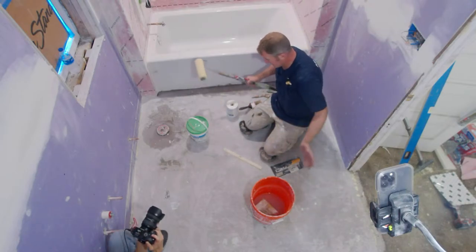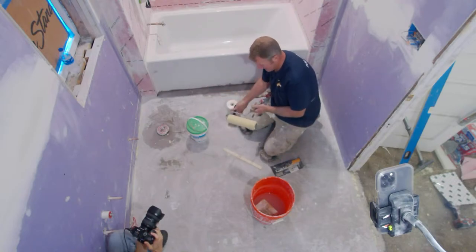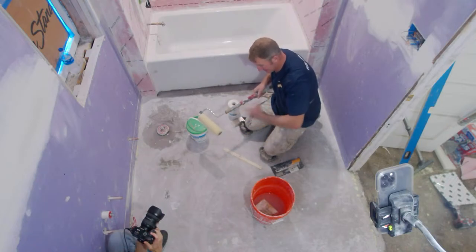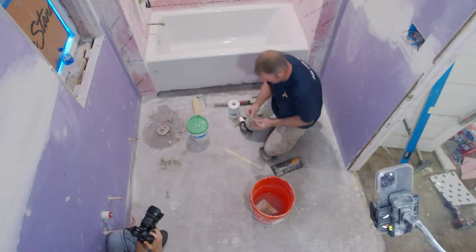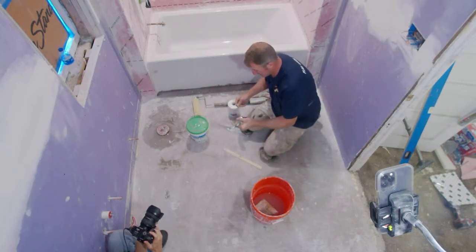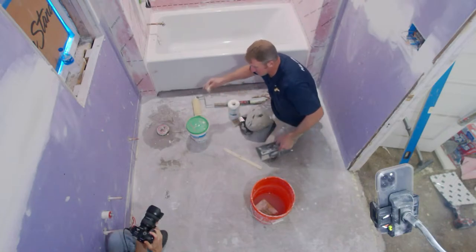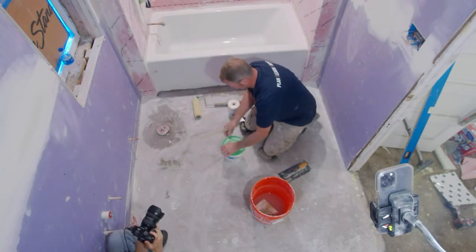All right, so the supplies that you need are pretty simple. Not much different than painting, really. A paintbrush to go around the edges, and a half inch roller, so that you can make sure that you get a copious amount of this on the floor. This isn't 100% necessary, but this is a film gauge to double check the thickness that you're putting down. My Ditra or Kerdi trowel is basically 1/8 inch. This kind of gives me a reference, but really you just want to make a nice, really thick coat of it. We'll demonstrate that shortly, but you want to mix up the product before you get started.